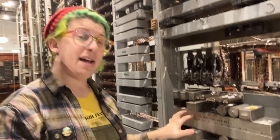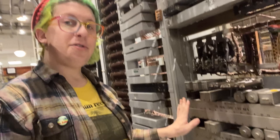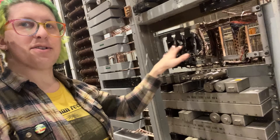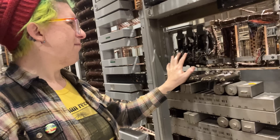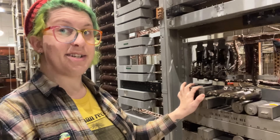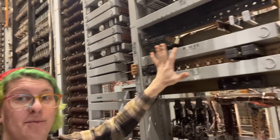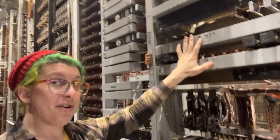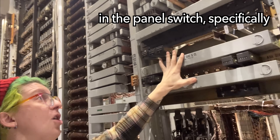The automatic test line is something that you can dial into and it will do tests on a subscriber's telephone without the aid of someone sitting in the central office doing the tests for you. So we have three test lines here — one, two, and three — and their associated selectors. These I believe originally came from New York City and they are wired up, but I'm pretty sure I'm going to have to move them. This stuff up here is for MF or multi-frequency sender testing. We're never going to use it because our senders in the museum can't do MF, so it's got to go. So we're going to open up some space there.